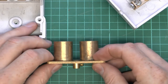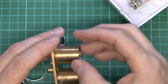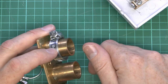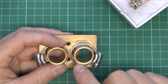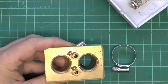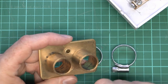This piece is for the armoured cable. Unlike using proper glands, these are actually supplied with two of these fittings. You put the actual wires and bedding through the centre, and then the armoured strands come up over the outside of this brass piece, secured in place with this clip — you just tighten it down and it reduces the diameter, clamping the wire strands to the outside. That arrangement might seem a bit basic, but that's how they're supplied and intended to be used. It's got a thick section of brass, so even tightened to a huge extent it won't be damaged — it provides a good solid connection. Terminals on the back enable connection to the earthed part.